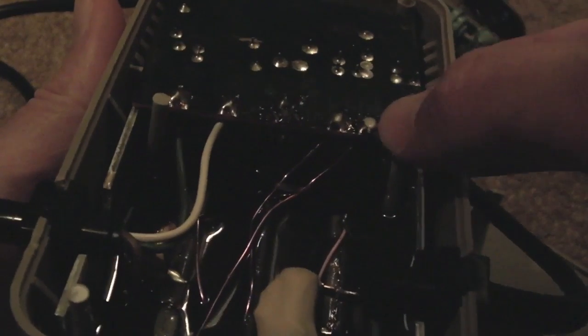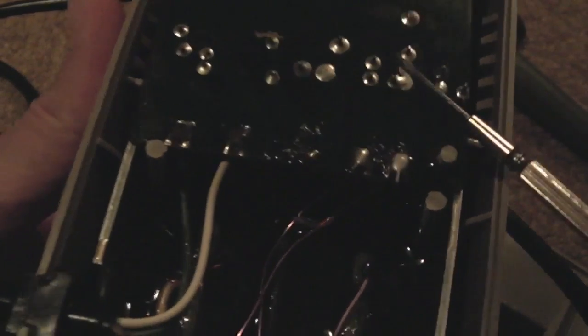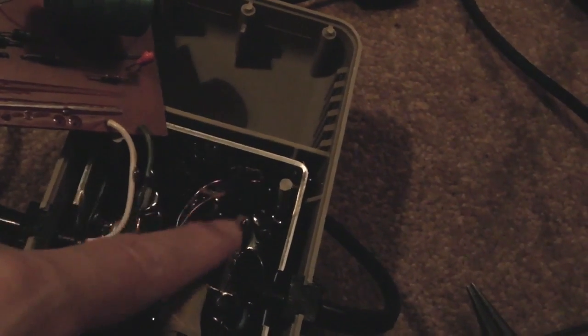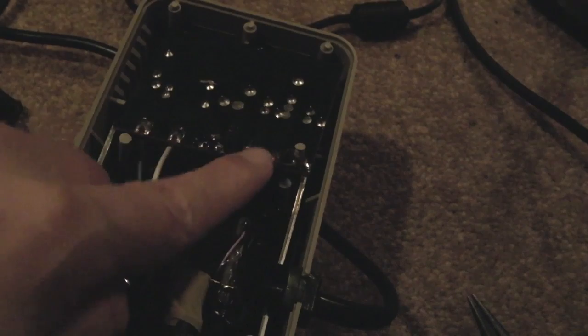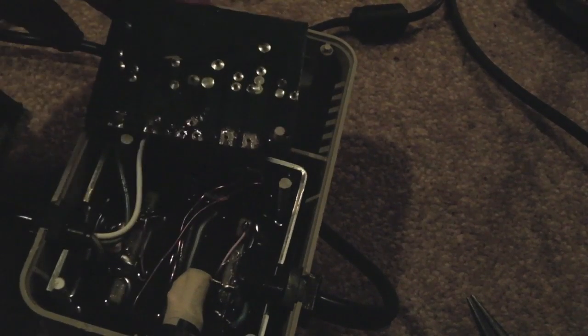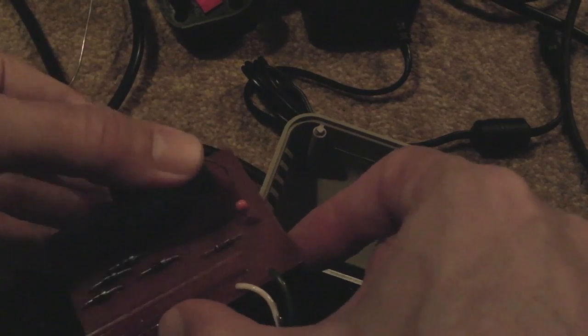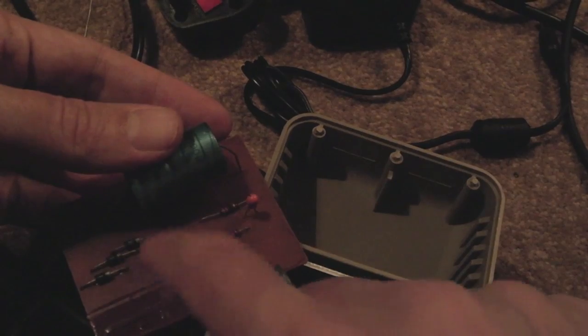These two here might be a bit problematic as the potting is quite deep, but I should be able to lift it up and bend it to get access to the components. You can see the two pillars here — they've been broken off previously when someone's been in this in the past. They're not really designed to be serviceable. I'll get that regulator off now. I can check this cap on my cap meter, and there are a couple of resistors here. I think that's another cap — possibly a tantalum. And we've got a bridge, so I can check these diodes as well.